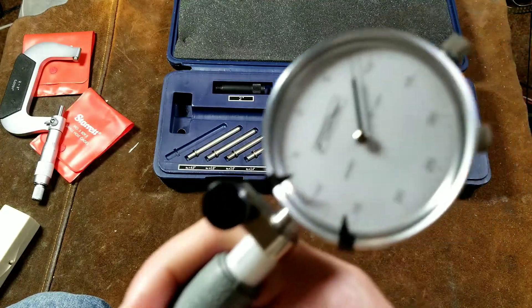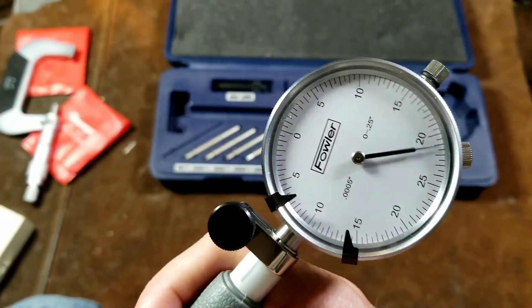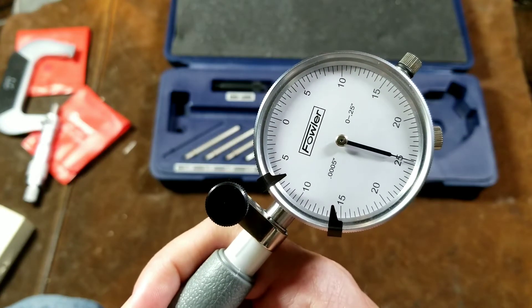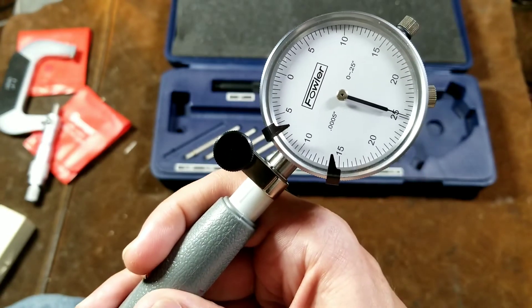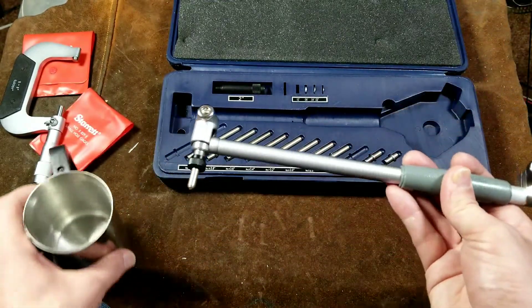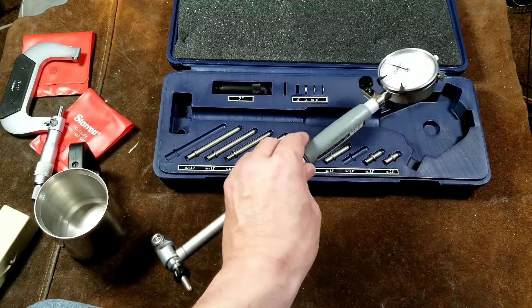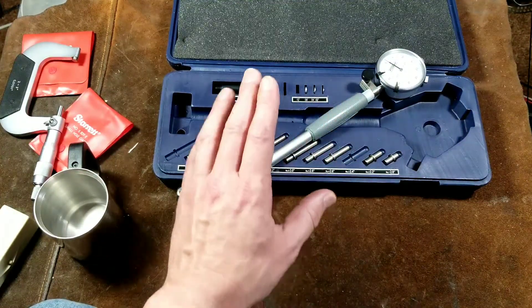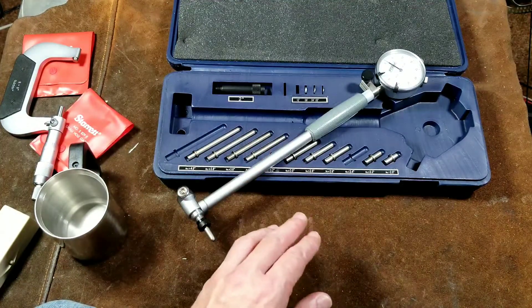But where the tabs where the handle were welded caused it to warp. If I measure perpendicular to that, I can see that it's 25 thousandths oversized. So the difference there would be 20 thousandths of oval. And so that's how these gauges really can save you a lot of time and effort, because it's much easier to detect something like that. You may have ovaling that only happens in one area because there's a material defect.